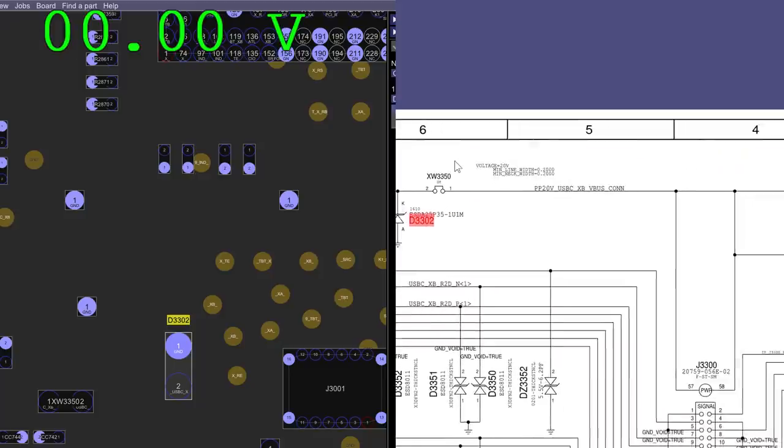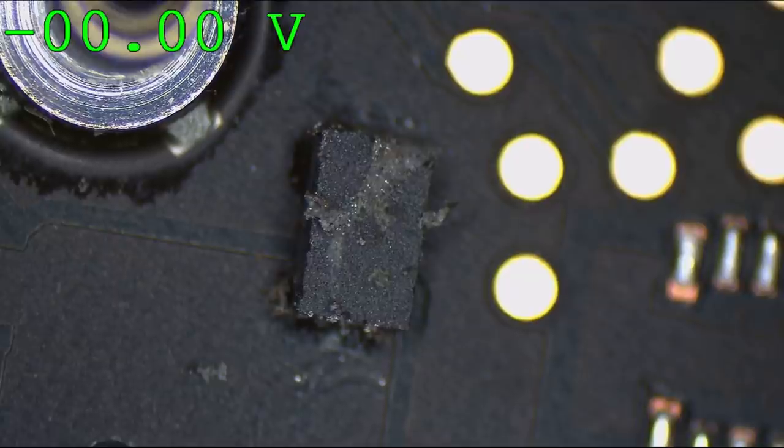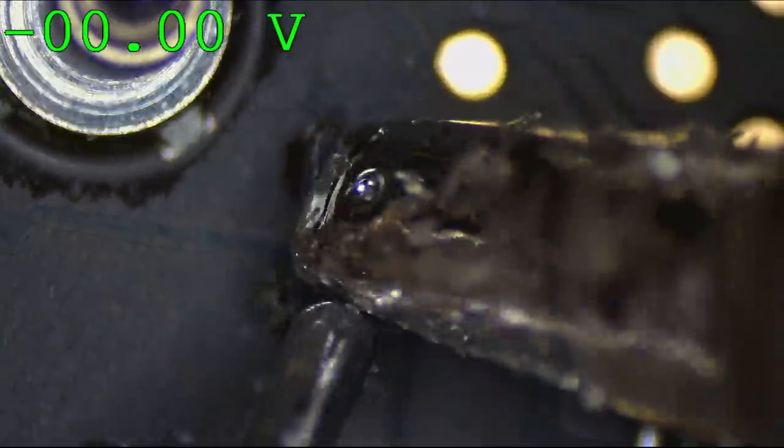Diode to ground on the DCN line. Wonder if that's what could be doing something funny. It does have a little solder ball next to it. We're still not getting PP3V3_G3H yet after removing that other solder blob mess. Next up, let's get this diode off. I don't want to use hot air because it's so close to the damn ports, but it doesn't seem to want to come off with the tweezers. What if I just do this?